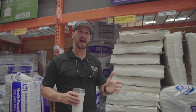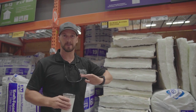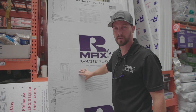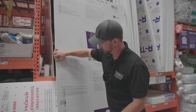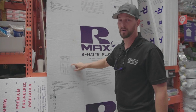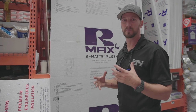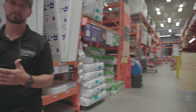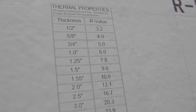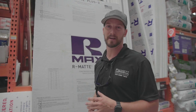Anyone that gives you plans or has a plan that has batt insulation showing on the inside of a shipping container, don't go with that. So these are going to be a closed cell board. This is a really thin one — the half inch. Most of the time they're actually going to have a little chart like this to help you figure out your R-value.